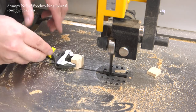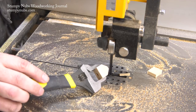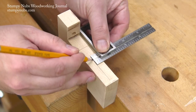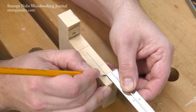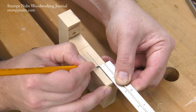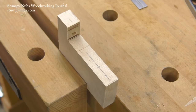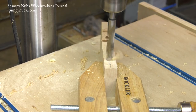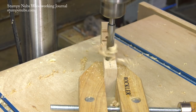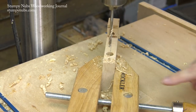You'll need a bit of a point on that cube. I use an adjustable wrench to hold it while keeping my fingers safe — just don't cut into your wrench. Find the center of the notch that you cut in the larger block, then mark two points on that line: one a half an inch from the end and the other an inch and an eighth from the end. Back at the drill press, at the point furthest from the end bore a half inch hole an inch and a half deep. At the other point bore a three sixteenth inch hole three quarters of an inch deep.